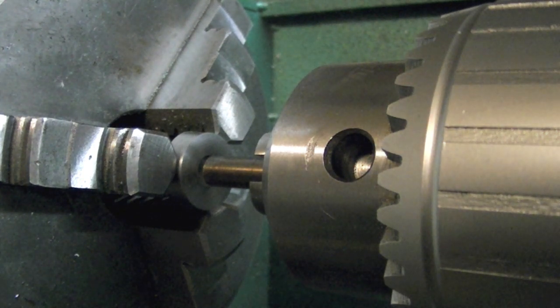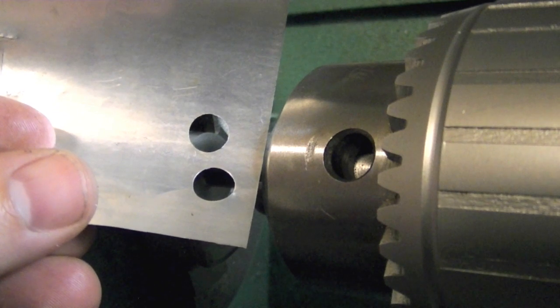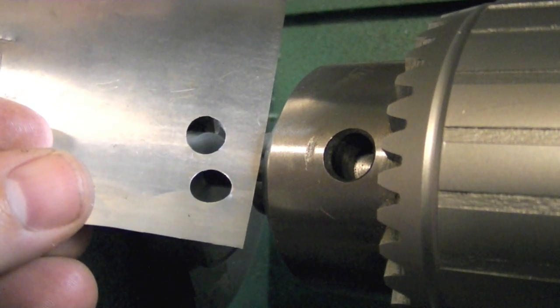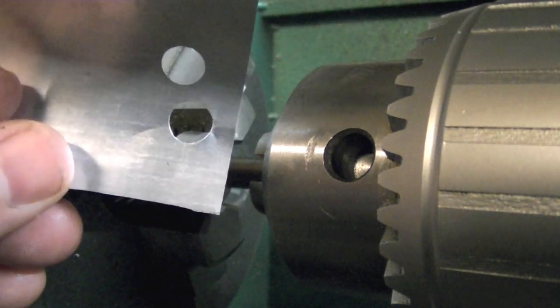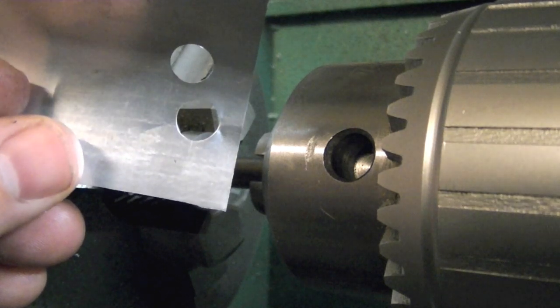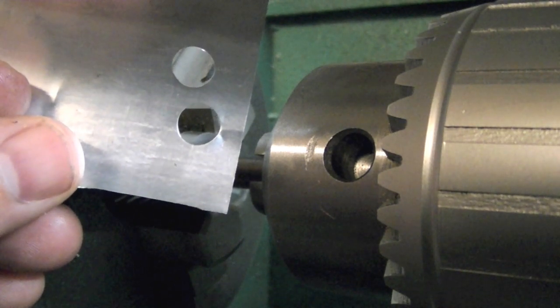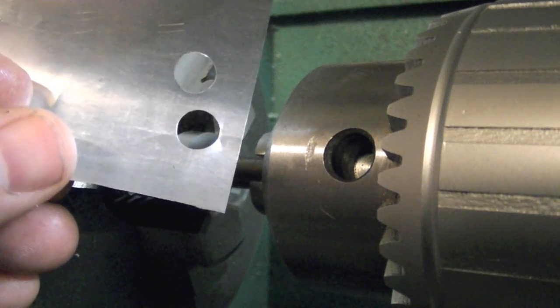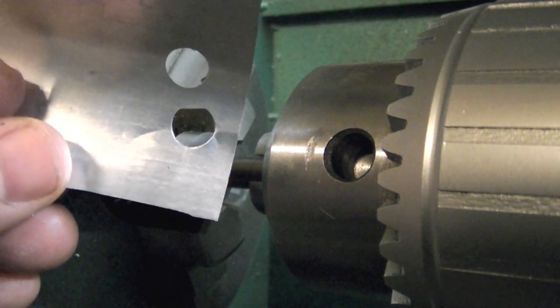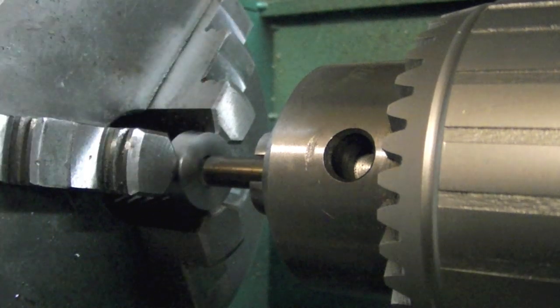That cup shape helps because you're not trying to punch along the entire circumference of the punch all at once. One other tip: if you want to make sure your material doesn't pucker when you punch it, don't take the die out of the three-jaw chuck between uses. For example, in this piece of aluminum you can see the top hole was punched a few days ago when I first used this die — but the bottom hole, which I punched this afternoon, you can see the pucker around it. That's because the three-jaw chuck centers it pretty close but it might be off by two or three thousandths of an inch. You could use a four-jaw chuck and dial it in to get better results.